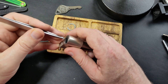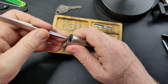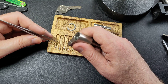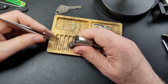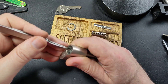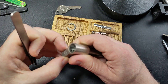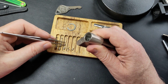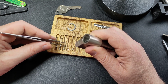Let's take a look at the key pins — the shim is still in there, always forget that. First pin is some kind of spool, second is almost like a bowling pin shape, third is spooled. Let's get the springs as well because they look a little bit different — yes, a little bit. One of them is from some kind of chain, which explains one of the false sets.